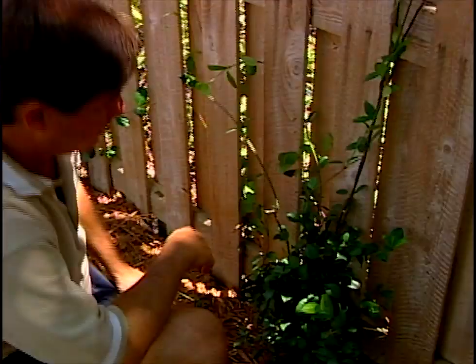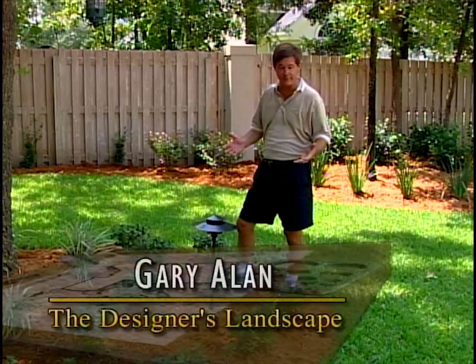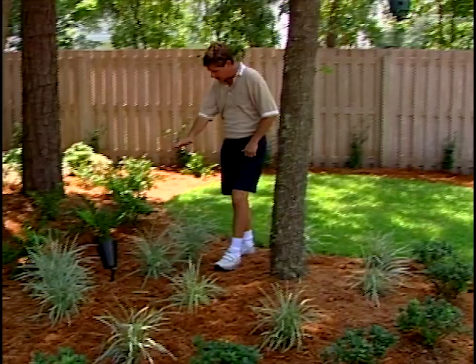Different lamps and wattages are used to create different effects, like this illuminator here. Not a plastic fixture but metal, and that will light about a 15-foot radius. You can use these for pathway lighting, but in this case a combination of the landscape bed and the sod line. For a stronger fixture up along houses and homes, the power lighter does a great job reaching way up, like along the chimney, and to frame the house in. Its application here is to blow up the trunks of these trees and the canopy back in the corner.